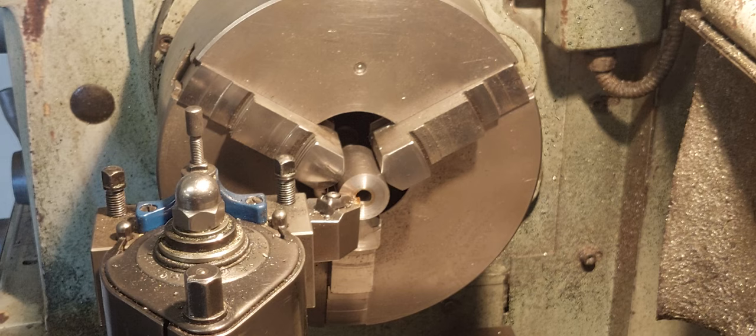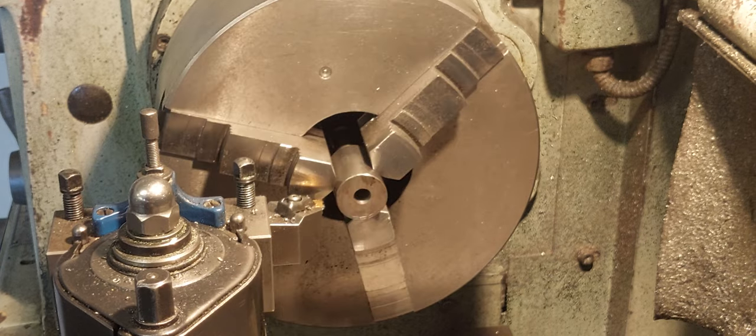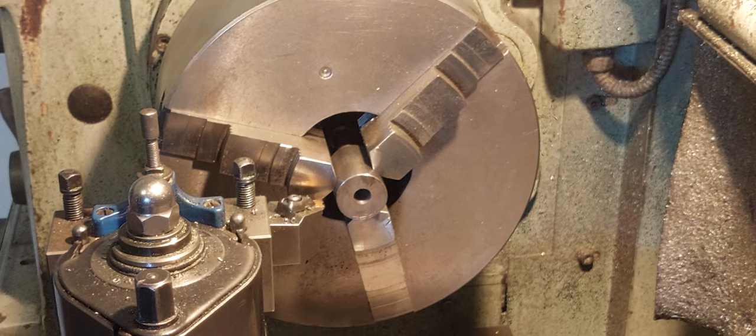After the first face off, take the part out, measure with the verniers, do your recalculation, and wind in the appropriate amount. If you've got a DRO it's a lot easier; if not, you'll have your dial indicator on your saddle. Set your zero and then just go bang bang bang and you've got all the bushes done to the same length. I'm taking off approximately 0.4 to 0.6mm — this is just a sample video. Calculate your overall length from your stock material, take off the appropriate amount on your first cut, leaving enough for a final cut to hit your overall length.